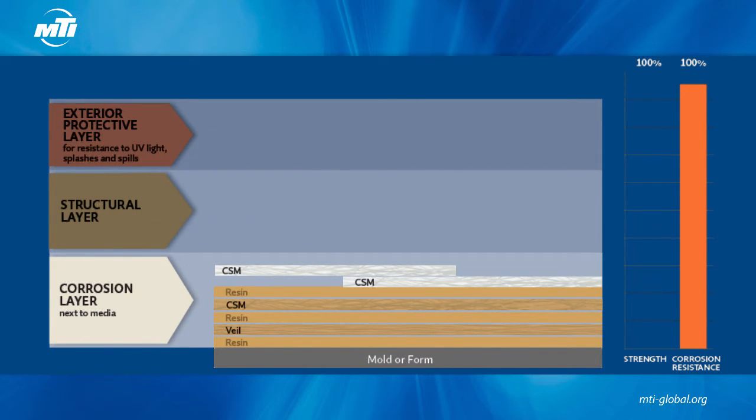However, you must make sure the two sections overlap each other. We overlap the material to ensure the continuity of the laminate strength. The addition of the CSM adds significant resistance to cracking to this first layer. However, the strength is still low at this stage.